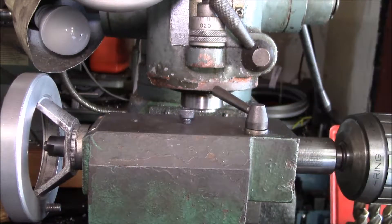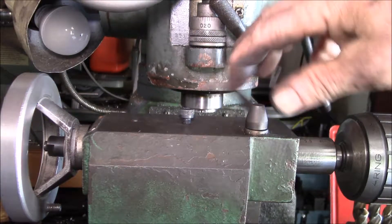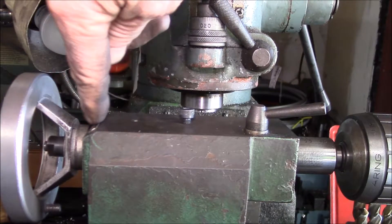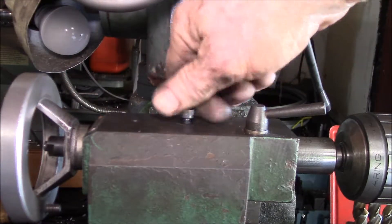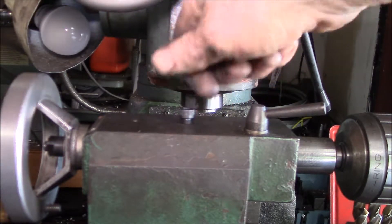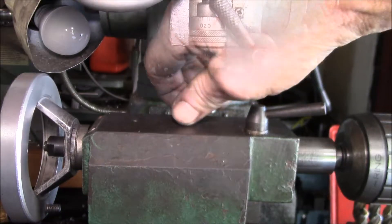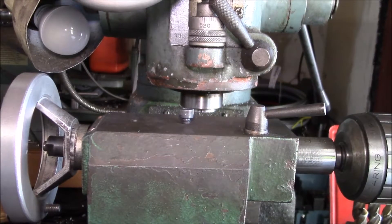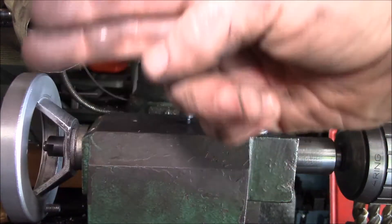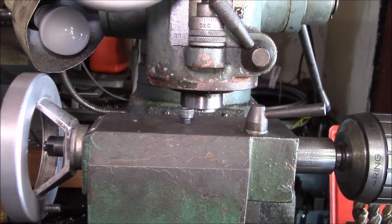I think I'm back in business. You've got to fix this before you can work on anything else — break a blade in the band saw, have a part like this fail, and you've got to take a couple hours to shut down production and fix the machinery. The way to go is take an M6 by 1 socket head cap screw, cut it to about 10 to 12 millimeters long, knock a few threads off the end — I think that's much better. Anyway, I thought I'd show you that quick repair. Any questions, post up in the comments below, and as always, thanks for watching.